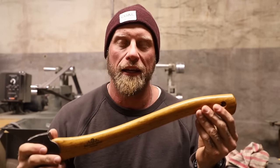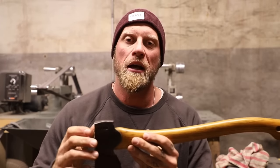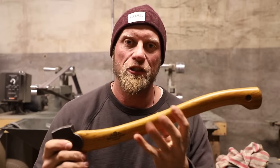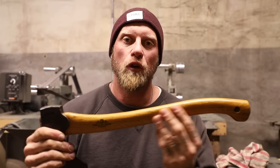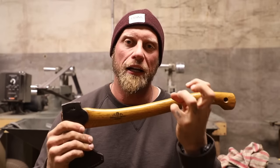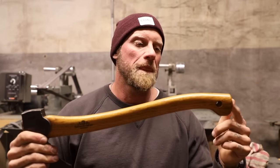The reason I like to add turpentine is it helps with the drying process of the oil — the turpentine helps the oil dry faster. It's not 100% necessary, but what I've found is if you put just linseed oil on your handles, they'll only absorb so much at a time. If you don't wipe off the excess, your handles get sticky and weird and you really have to use them a lot to get that stickiness out. When you mix it with turpentine, the mixture gets a lot more watery and less oily, but the oil is still there. It absorbs a lot better into the axe handles and dries that oil quicker inside, creating a sealant that doesn't allow moisture in.